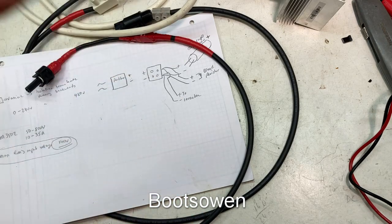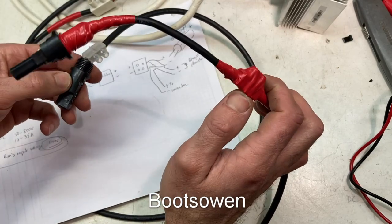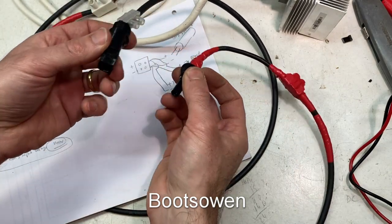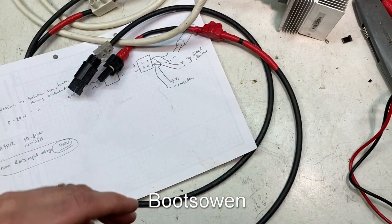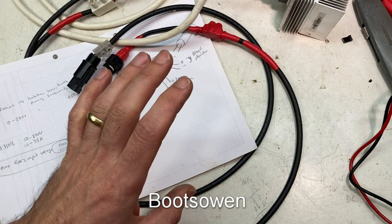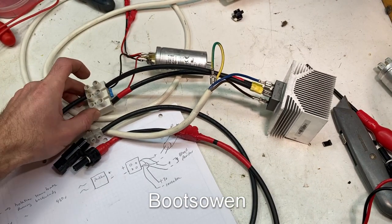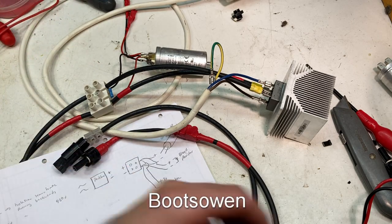The most important thing — and you can see I've got red tape all over this one — check AC and DC, check the DC side, check positive and negative, make sure that you've got them right and that they're corresponding, because the plugs on some things I've been told are the wrong way around, and that would be tricky and a disaster. Questions or comments, leave them below. Any advice for me would be helpful. Any worries about capacitors — tell me about it — but this capacitor here has a bleed resistor so I'm not going to touch it now.